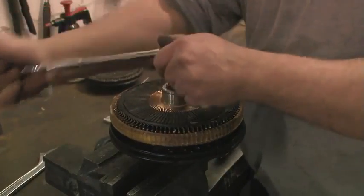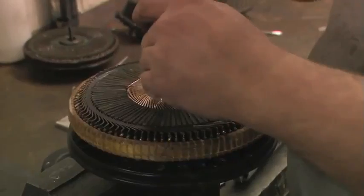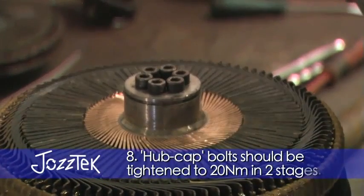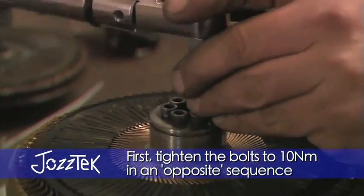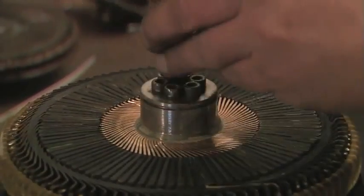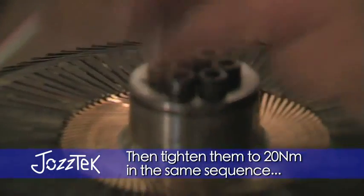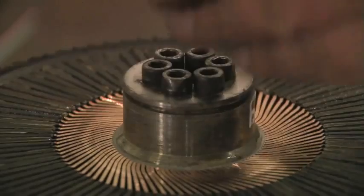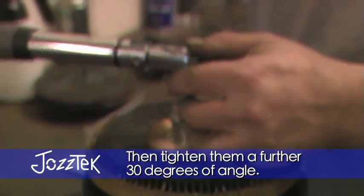This isn't in the manual — the center bolts are supposed to now be all torqued up correctly, so we loosen them off. And it's 20 newton meters, which we shall do in two stages. The final torque figure is 20 newton meters in sequence, and then 30 degrees — so we start there and turn it 30 degrees.